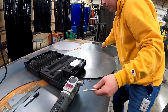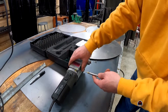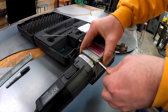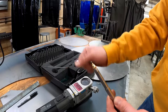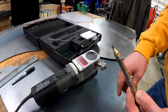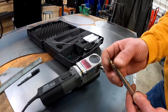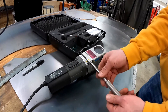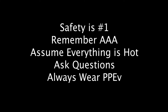I'm going to show you why this doesn't work. If you have an electrode like this, this is not going to work. If you put this in the sharpener, you'll notice it just gets caught and it doesn't get set to a predetermined length — see how short that is? We're supposed to be going into the distance-setting mechanism on this, which is just a hollow cavity. This electrode is too large to fit into that cavity and is not set appropriately. So remember, if you have an electrode that looks like that, you need to go ahead and cut that off with a hacksaw.